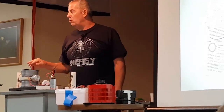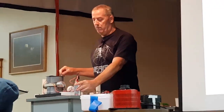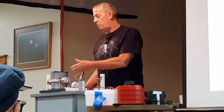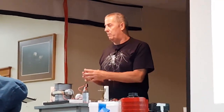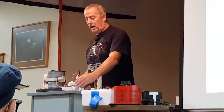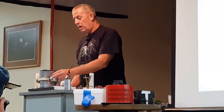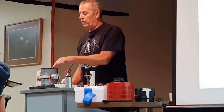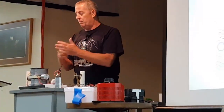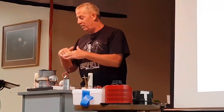What you want is absolutely no spark whatsoever. That's the ability with this. You want to be able to tune this until you see no spark, because if you run it and see the spark, you're going to put pits all over your commutator metal, and you really don't want to do that. So that's your capacitor here, your coil here, and your magnets. I just put two neodymium magnets on the end, the square ones that have the screw, and jammed the shaft right on through, well, half through, because when I changed it I had to put a shaft here and it's like half welded.